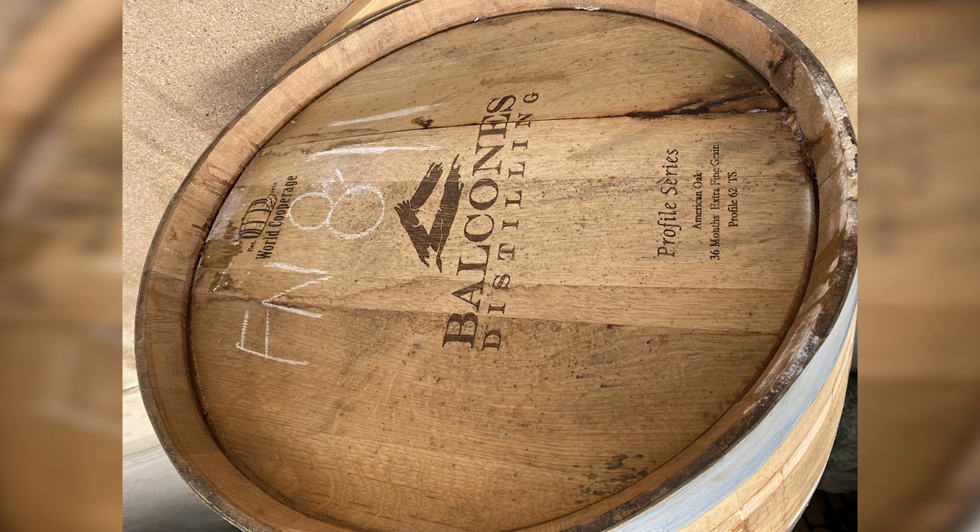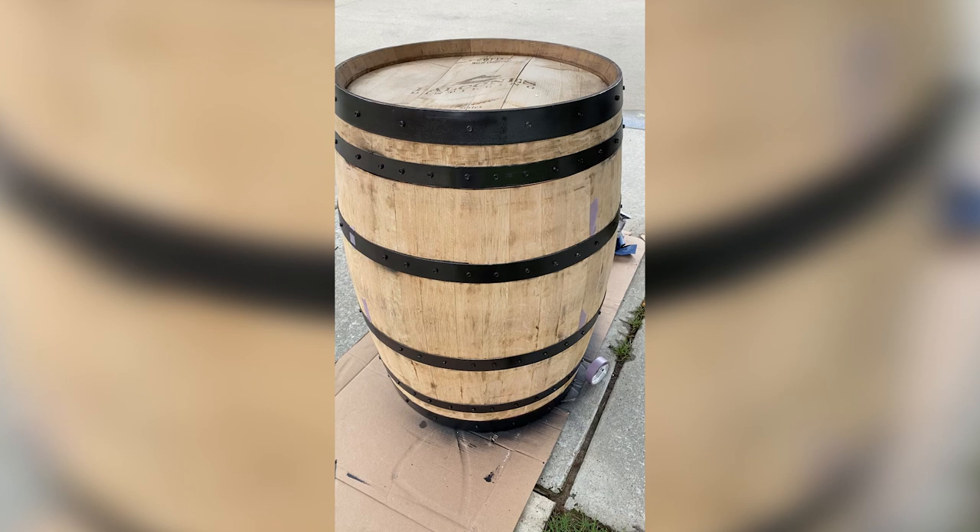Structure is part of what it takes to make one of these barrels. So tell me, what's the first thing you do when you get one of these barrels to convert it into a barrel cabinet? Really it depends on the status of the barrel — did it have wine, whiskey, beer? So many barrels get used after the whiskey industry. My first step is figuring out what was in it and whether I need to neutralize anything to kill bacteria. I'll do a baking soda and lukewarm water solution and keep it for about 24 hours on one side.